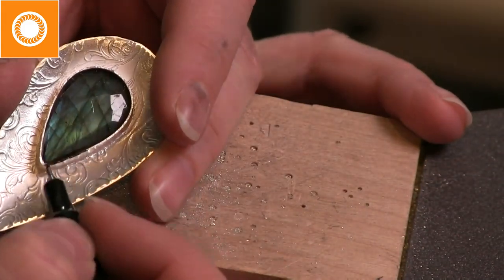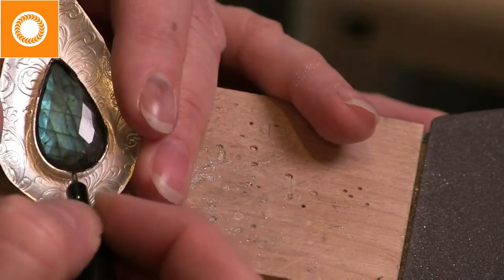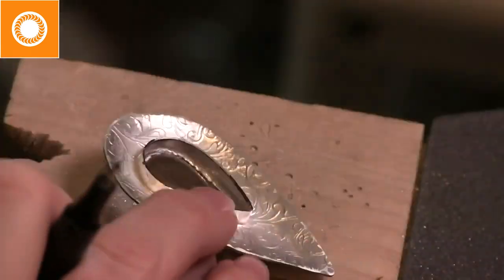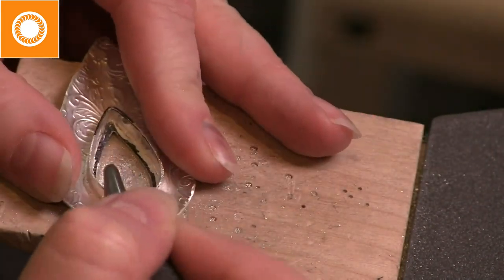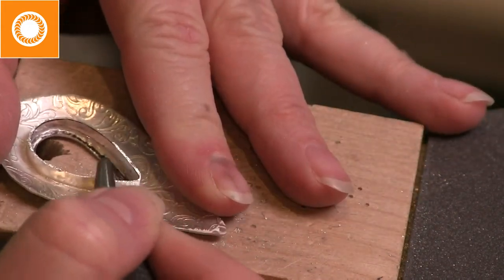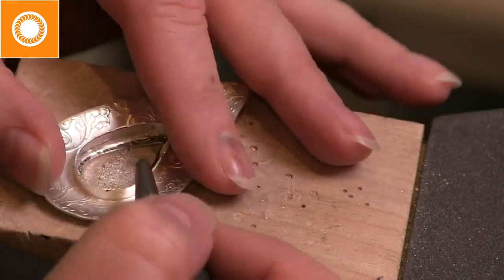Because I already have a line on the inside, now I'm going to draw on the top — this shows me where I need to concentrate more grinding effort because I don't need to do the whole thing this time. I just need to concentrate on a few spots — in this case at the top and down on the bottom. So I come in, grind that away, then go back in because I've now got a burr on the inside and I just knock it down a little bit.